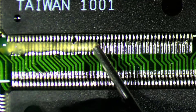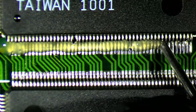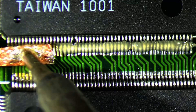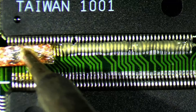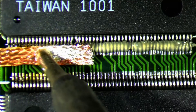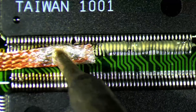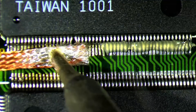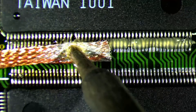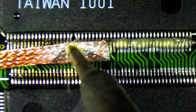But now let's go back to our Diamond Monster 3D. The first thing I will do is to remove as much of the old solder as possible — that will immediately resolve one of the issues, getting rid of most of the solder bridges. I noticed that my solder wick works much better in combination with flux. If you are interested in any of the tools I am using, please check the video description.